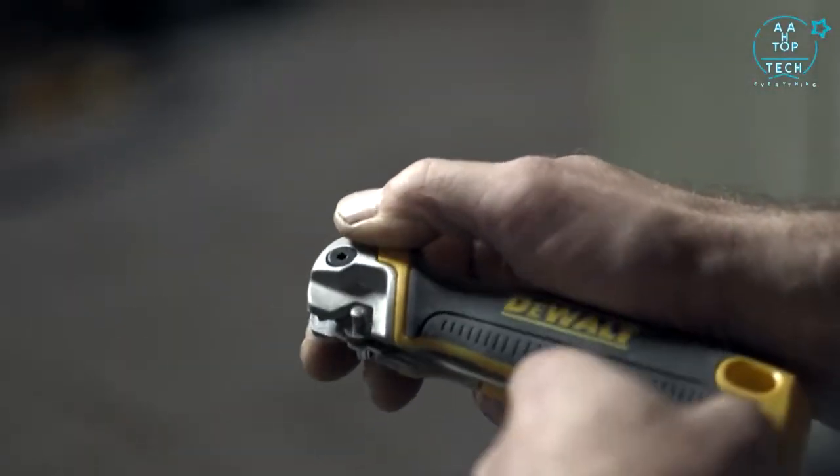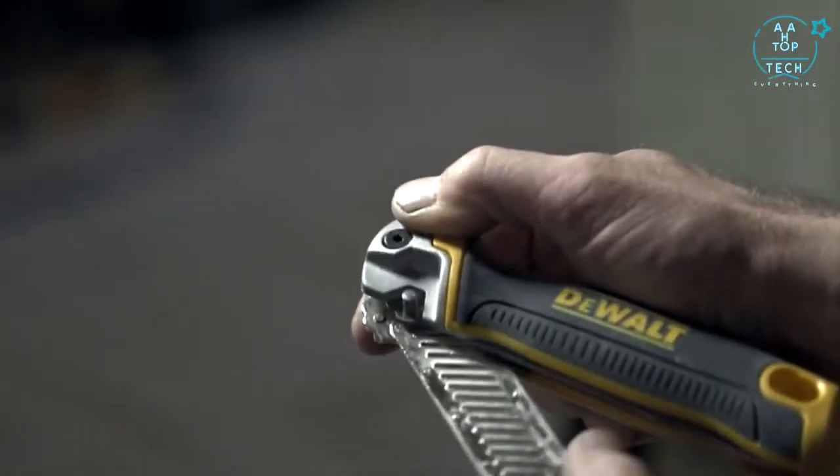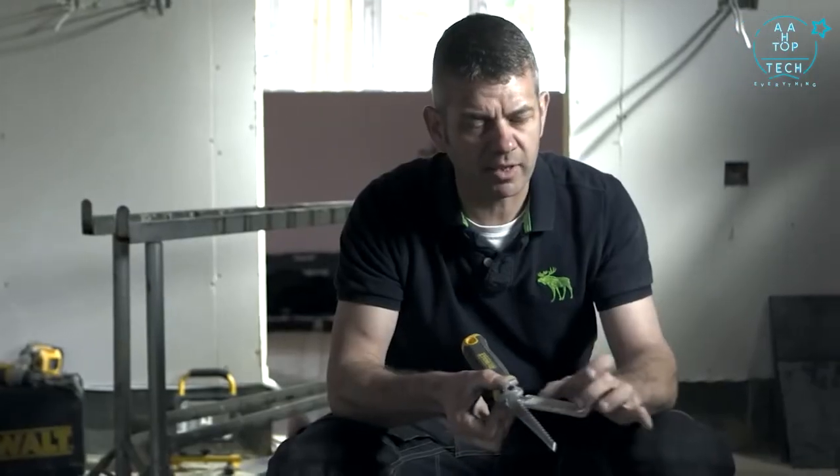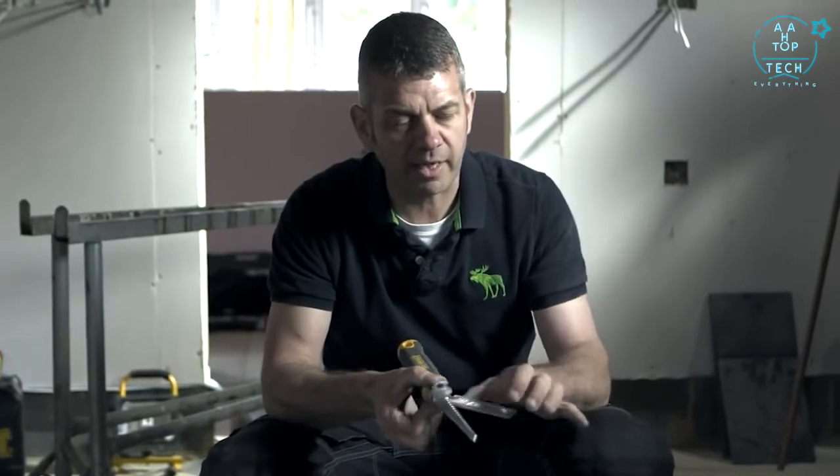Not only that, it also comes with a rasp. So if you're going back and resizing some boxes you'll need to clean them out after your plaster has been there. You can rasp it down rather than cut and smooth it down. Or if you've cut it out and your plasterboard boxes don't quite fit, you can just smooth it in.